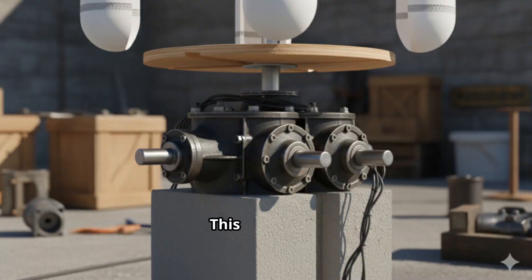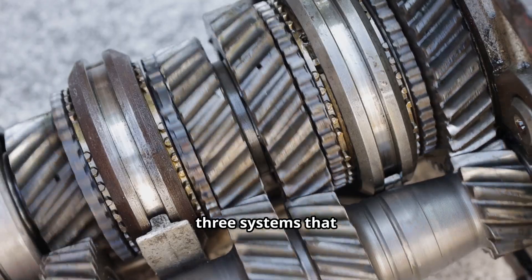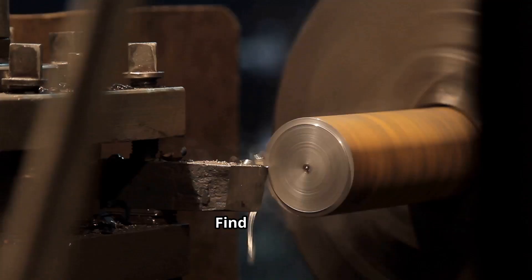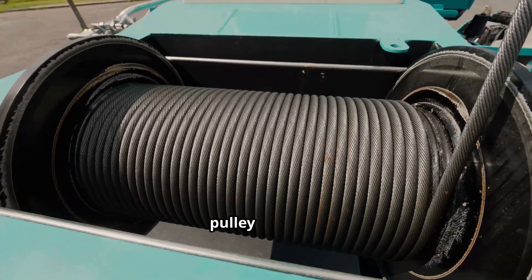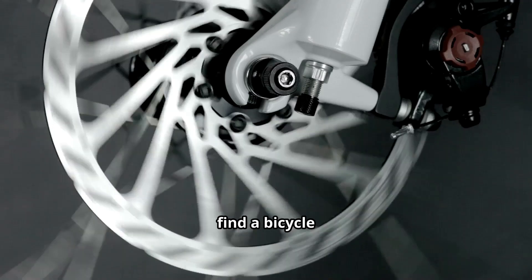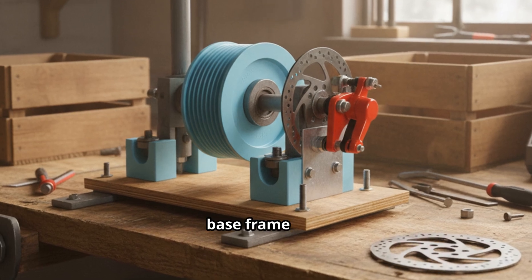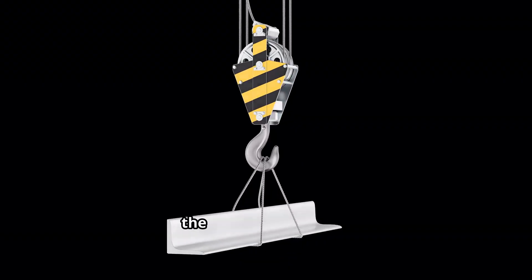All the heavy machinery is at the base, making the tower stable and easy to maintain. You will build three systems that all connect to one main shaft: the lift train, the generate train, and the brake. Step 7: Get the main shaft, pulley, and brake. Find a strong solid steel rod — this will be your main pulley shaft. Find a large pulley to act as your winding drum and mount it securely to the center of the shaft. Then find a bicycle disc brake set — the caliper and the rotor. Mount the disc rotor onto the main pulley shaft and fix the caliper to your base frame so it can grip the rotor. This brake is your holding system; when engaged, the weight cannot fall.